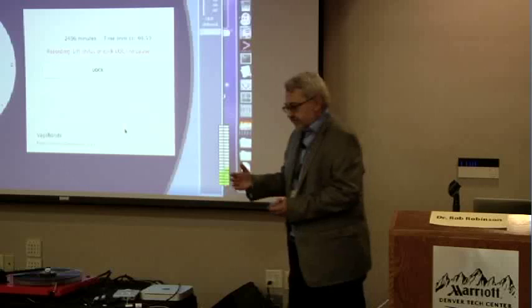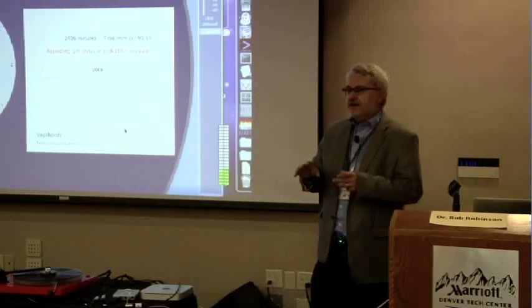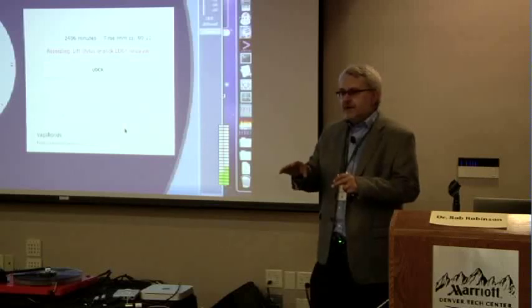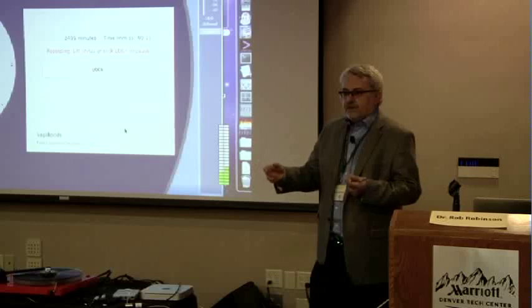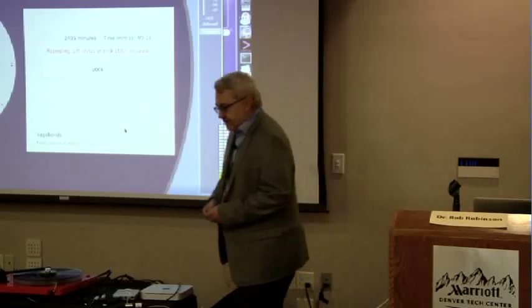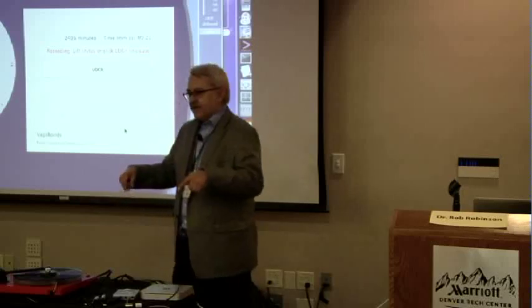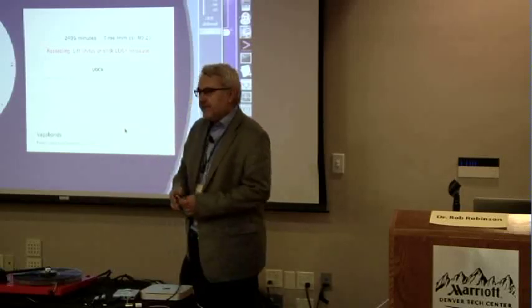The higher end approach is to get a better quality analog to digital and digital to analog converter and then use an outboard phono stage. My company makes several of these that have the RIAA curve omitted. You can order it with the RIAA circuit built inside for extra cost if you want to use it as a standalone phono stage. And to my knowledge, we're the only company that makes one that you can get with this flat output.